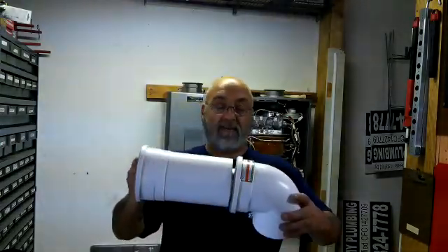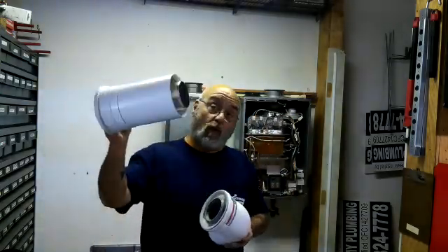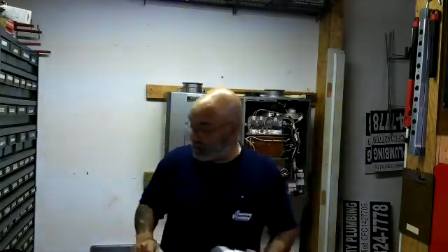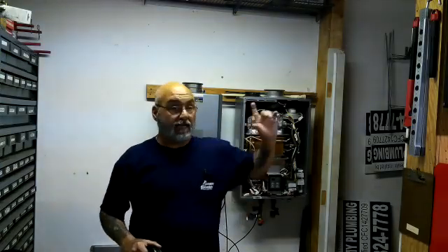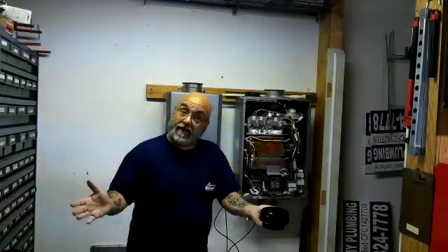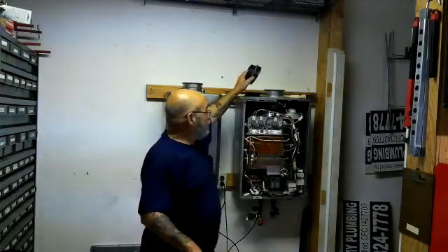This lube is for condensing — it will make it very easy to push in. If you use non-condensing venting on a condensing unit, the water's going to come back, cause the silver to erode, and mix carbon monoxide with the air — very quickly. So you have to make sure that when you order a condensing unit, you're ordering the concentric venting for a condensing unit. It will say it on the box. If you're venting with just PVC — whether it's an older R-98 or the new Sensei 2-inch — you don't have to worry about it, because it's going to be Schedule 40 red-letter PVC.